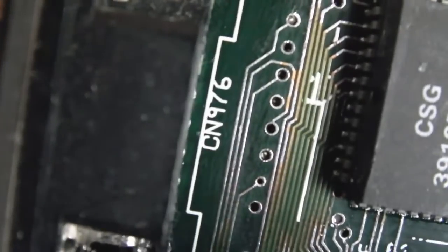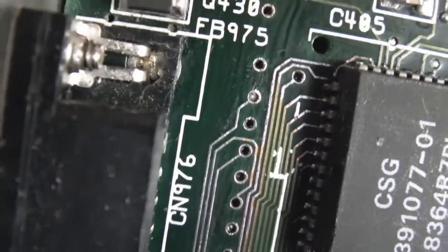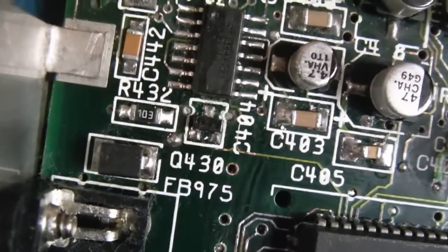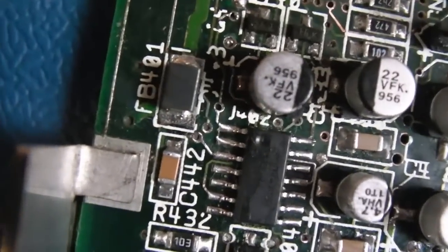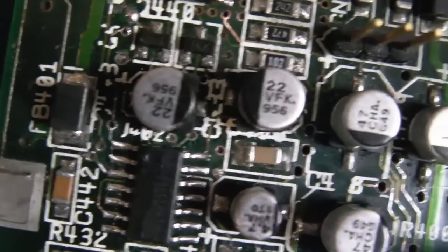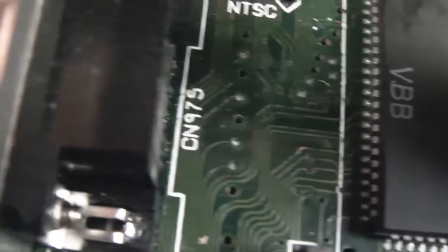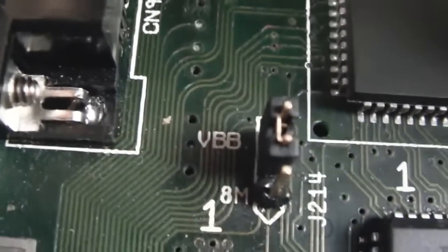And then over the cable, you can see I started to tin up here. You can see how much better that's looking, but there's still some coppery traces. And we need to go further up here as well. Ignore the sound sounding a bit strange where it cuts out, skips a note. It's just because it's playing from floppy. So lots of work down there needed.